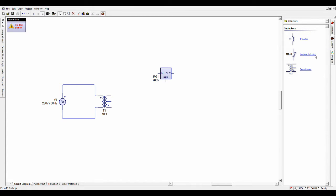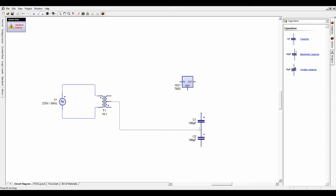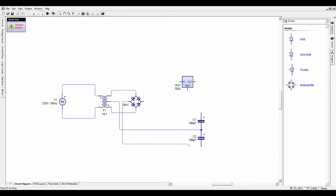So let's take out here, and this 0 volts trails off. We are going to need a bridge rectifier, which the inputs go like that, and the outputs go to the negative and positive, like on screen, basically. That should be working. As you can see, there's about 16 volts on the output, and minus 16 volts on the input. Now that's good enough, I suppose, for a very simple rectifier.